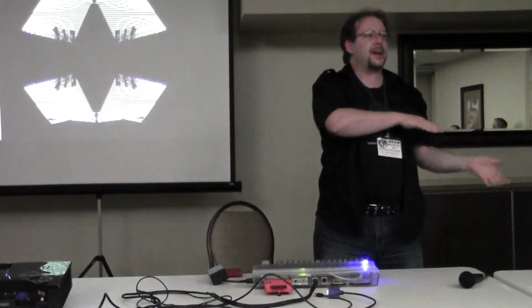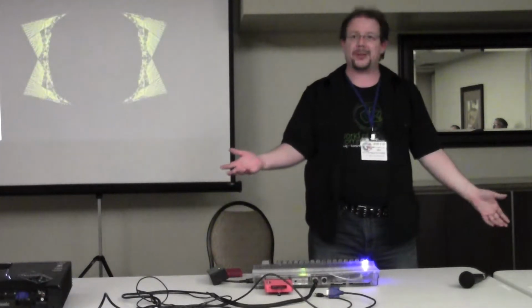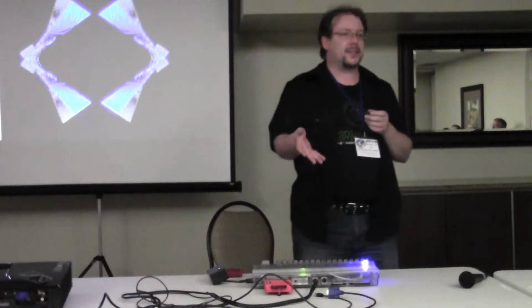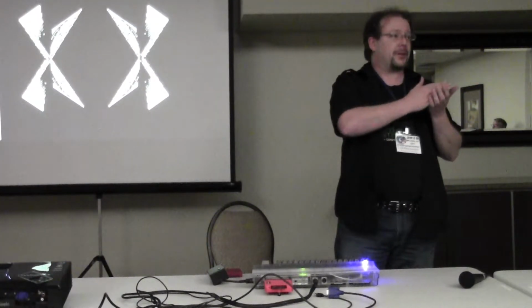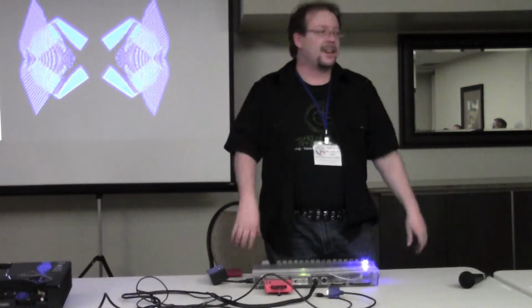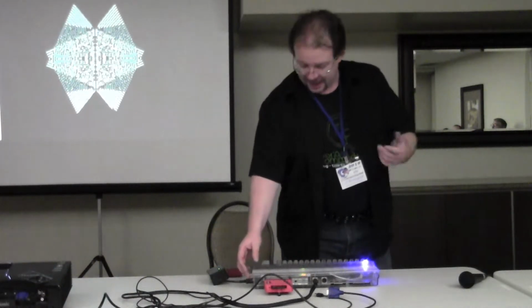And then Commodore came out with the 8580, and they fixed that bug, and suddenly this fourth voice disappeared from all the games that were using it. So this digi voice had samples, drum samples, speech samples. They all stopped working. So what the SwinSID Ultimate does is it brings the best of both worlds. That original popping phenomenon is recreated, but you have the updated sound. So the SwinSID Ultimate can detect that, and it has a fourth LED that I'll show you because blinking lights, and that's the samples. You like blinking lights? It seems to be a theme.